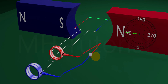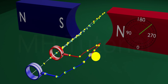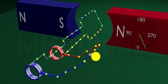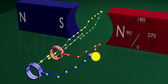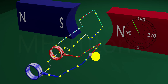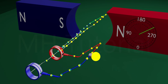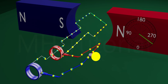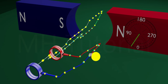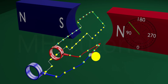If the armature rotates, the induced current will light the bulb. Note carefully how the current changes its direction: at one position the current in the bulb is directed from red brush to blue brush; after some time it is from blue brush to red brush; and then it is red brush to blue brush again. So it is an alternating current flowing through the bulb.